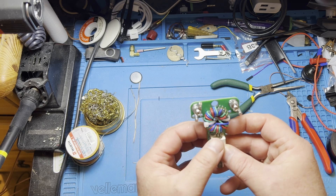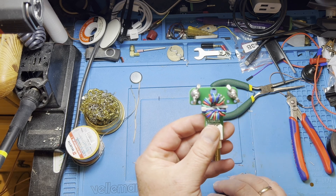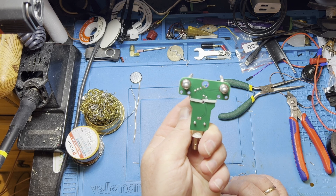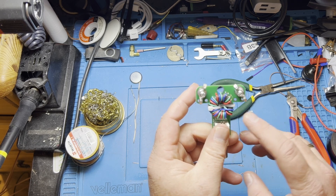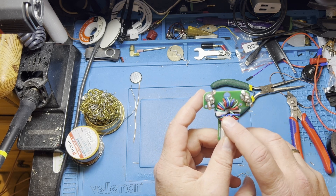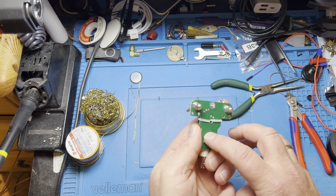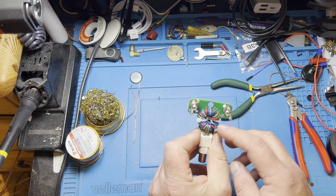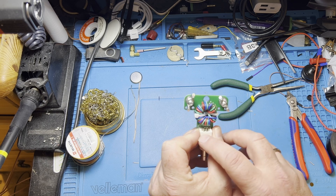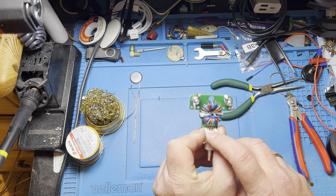I haven't measured anything, but I reached out to AliExpress since they sponsored me with this, and asked should I just drop the review, or should I make a video on fixing this balun? And they said go ahead, make a video of fixing it. So what I'm going to do is take the toroid off, desolder the wires, figure out how the traces go with a multimeter, and rewire this as a 1-to-1 balun — just because it says 1-to-1 here, and I like stuff to be what it says on the label.